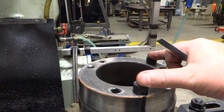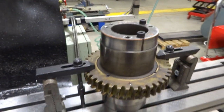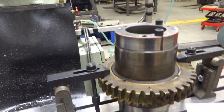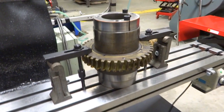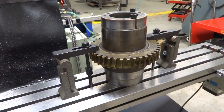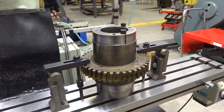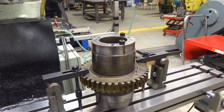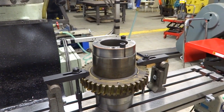That's my method for clocking this so I can get these holes lined up. I've done it once before — about two years ago I made a brand new shaft for these. They had buggered one up really bad, cracked it from one end to the other. I made one out of 4340, heat treated and stress relieved — a much stronger material. I had the same issue positioning the holes in each end, and this was the method I used then. It worked well, so I'm just going to do it again on this one.